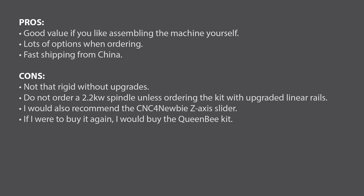So my final thoughts on the machine: I feel like it was a pretty good value if you like assembling these machines yourself, and when ordering there are a lot of different options so you can really get what you want. The shipping was expensive but it arrived quickly — I think less than two weeks. The things I didn't enjoy were that the machine just wasn't that rigid without doing a bunch of upgrades. The heavy spindle was just way too wobbly without adding linear rails to the x-axis. I also separately bought an x-axis kit with rails and aluminum plates from CNC for Newbie and it made a big difference. I also modified the frame and mounted it directly to a really heavy countertop to help with the rigidity.